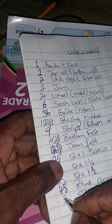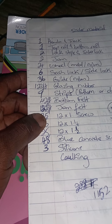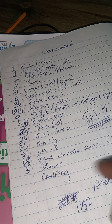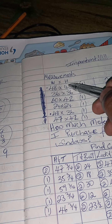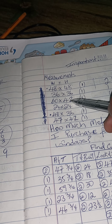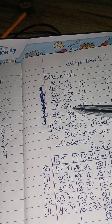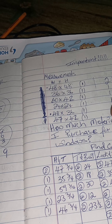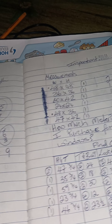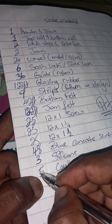But for your apprentice, you can still buy 3. That's why the system is set up that way — I've been there where we waste silicone. For a 4 by 4 window, buy 1 silicone per window. So: 1 for the 4 by 4, 1 for the 36 by 36, 1 for the 60 by 42 — that's 5 total. You basically can't buy more than 5 silicone because if you have half left you can still do the bathroom window. You can buy 5 caulking.